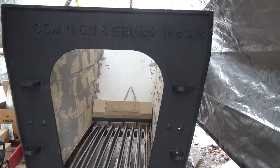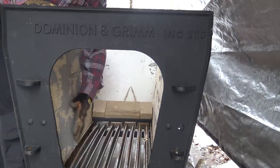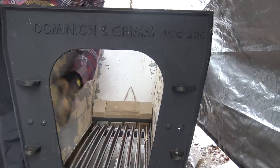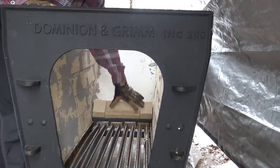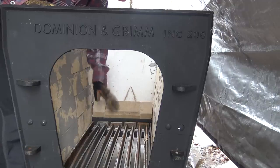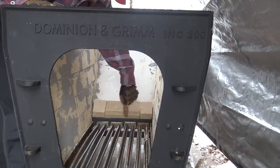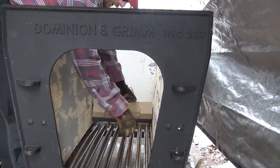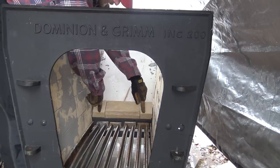Back up here working — it's Day 101 of my Big Wild Year. I have the two sides cut and mortared in place and I'm going to do a finishing coat on the inside after I get everything finished. Now I'm working on the bottom row of bricks coming up the slope. I started with a full brick, and as mentioned, it's kind of critical to cut the angle or edge off the brick so that when you want to lift your little fire grill out it doesn't hit the bricks.